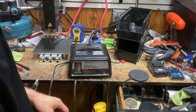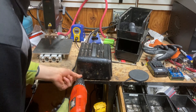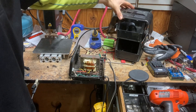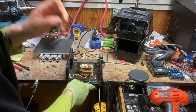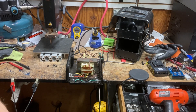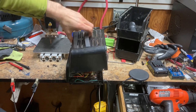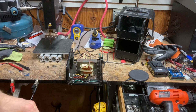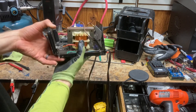All right, we are unplugged — that's key. Let's open this up. At this point I usually like to quickly look things over, then I'll often plug it back in to see where the power failure is. I unplugged it while taking the screws out and lifting the cover off so I don't accidentally contact something, hit a loose wire, or short something out.